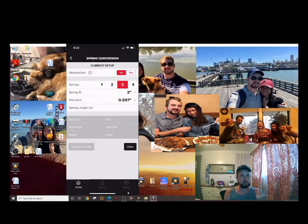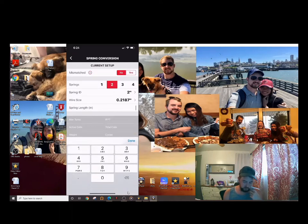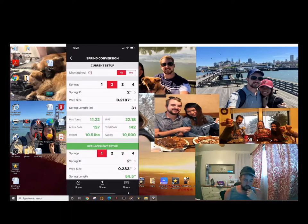Let's walk through a couple different scenarios. First, if your springs are the exact same size: click two if there are two springs, three if there are three — though two is most common for a double-wide door. Let's say it's a 218 like mine, and type in the spring length, say 31 inches. The app generates the IPPT and the cycle rating. Keep in mind the app is not perfect on cycles — it always assumes generic springs are rated for 10,000 cycles, even if your door's springs were originally lower quality.